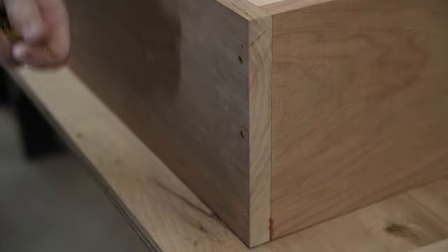All right, so at the beginning of the video, I explained how we came up with our jam measurements and our stool measurements. Now I want to explain the outer side casings and how I came up with those. The side casings are really easy. You essentially just take the length of the jams and add a quarter inch, because the bottom of the side casing is resting flat on the stool down here, and then there's a quarter inch reveal at the top. So that's really easy, just add a quarter inch, and a lot of this is personal preference.